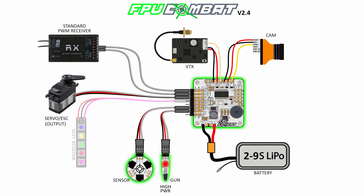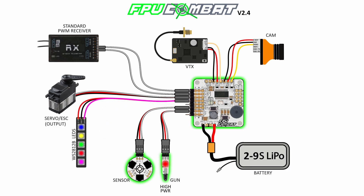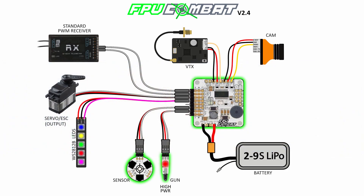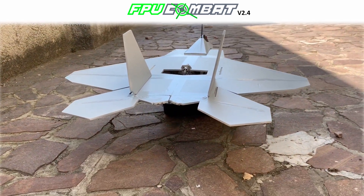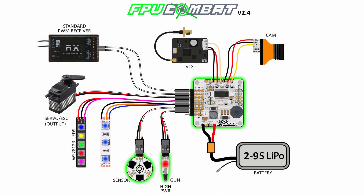If you want some visual feedback you can connect LEDs to the board. You can drive two different types. The first is WS2812B addressable LEDs, which are very popular. The board will control the color and brightness, and depending on the state you will get feedback in your field of view — useful for example with a digital FPV system. If you prefer more traditional LEDs, those that can be powered directly by 12V or a 3S battery can be driven directly by the board. Please check the documentation for more details about connecting these types of LEDs.